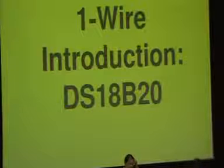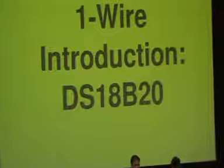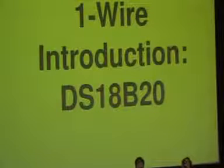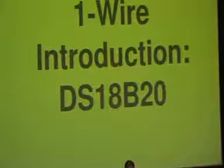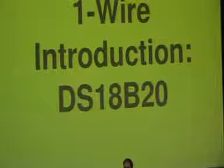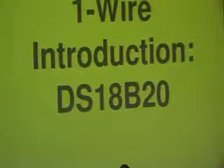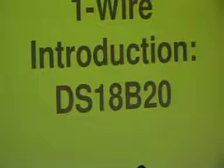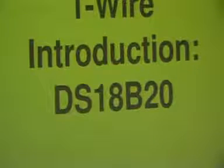So, one-wire introduction. There are a whole lot of little devices now that have some intelligence built into them, or they can communicate over a serial bus. There are really 2 major technologies that are extremely similar. They work in a very similar way, but they're like parallel developments. One is one-wire, which was originally developed by Dallas Semiconductor, I think it was, quite a long time ago. It's a relatively old system. They call it one-wire, but you actually need a couple of wires. They say it's one-wire because there's only one data line, but you still need a reference. With a one-wire bus, you can have multiple devices, each of which has its own ID, on a pair of wires, and then you can communicate with them individually. There are some devices around that are actually quite cool that use this. Now personally, I find one-wire to be really finicky. I don't know how successful other people have been with it.